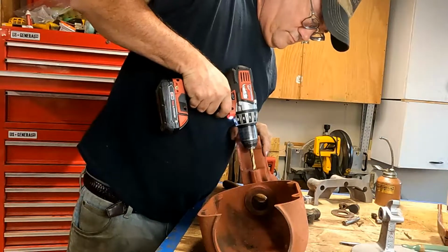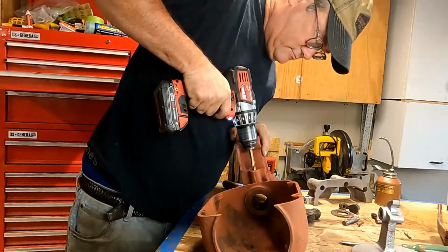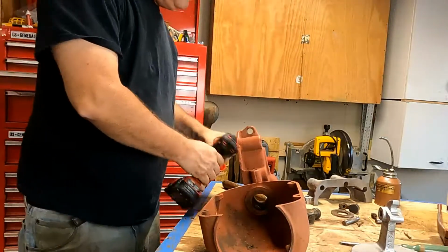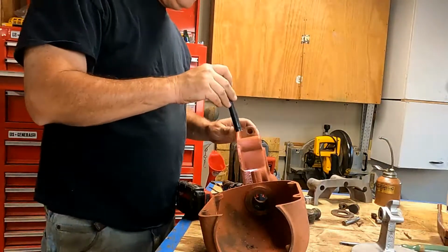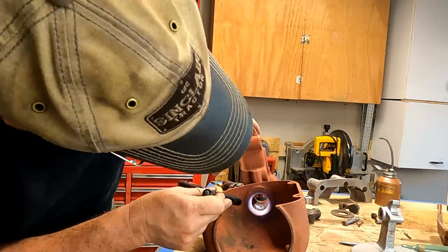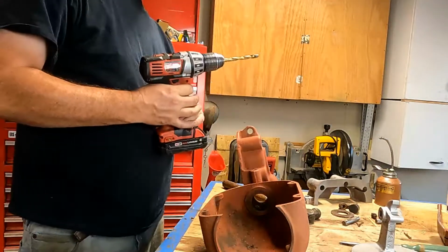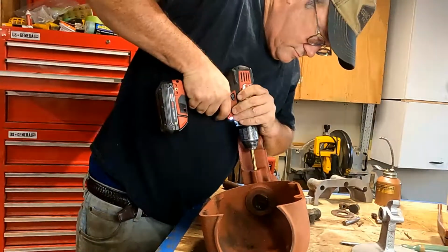You do a little work on this oil passage here. There's a drip oiler that goes right there where that drill bit is, and that's what oils that bearing that we're going to have to pour. And there was a piece of cast in there that was blocking the bottom, about 2/3 of the bottom. And I think what happened is at the factory, when they drilled that casting out, as they broke through, they chipped or broke a drill bit, and just didn't take the time to go ahead and chase it one more time. They just went with it, and that kind of happens sometimes on these engines.